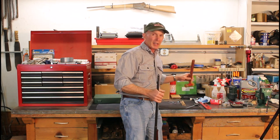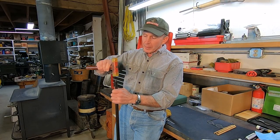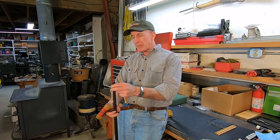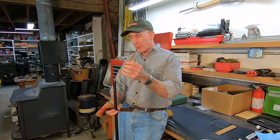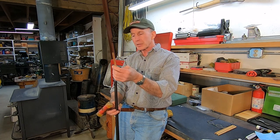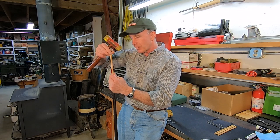Also, don't put the butt of your gun right on a concrete floor — these mats work well for that too. We're going to put that slug right in there, then grab a plastic or wood mallet — not something as soft as rubber, but hard leather works too. We're going to try to avoid beating on the crown. These 95s have a flat crown, but we still don't want to pound on them hard — these are nice old vintage guns. I've got rods about eight inches long; with this 30-inch bore I think I'll need four to reach the chamber area.